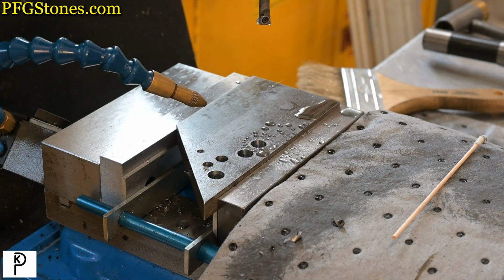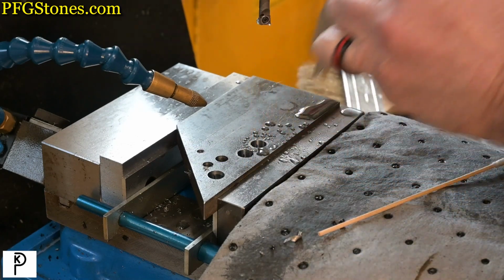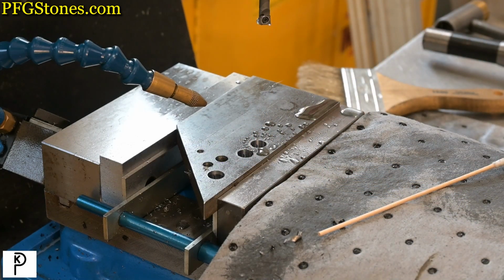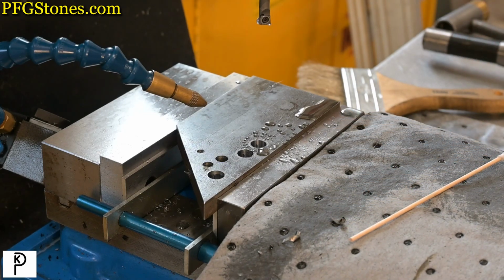So when we last cut it, it was 3.5 thousandths over on the diameter. Wow, 3 thousandths over the diameter. So that was a really fine chip. I like the prospects of that. So now what I'm going to do is cut it again and see if it changes. I'm not going to change anything here. Let's just see what happens.